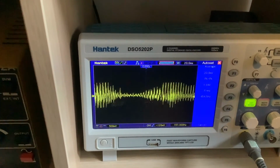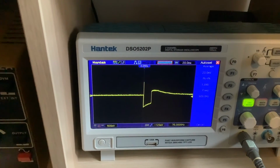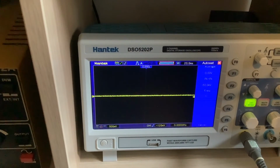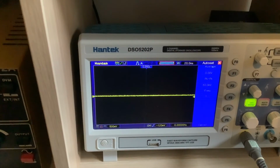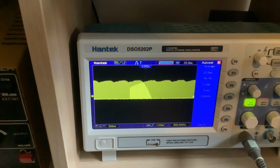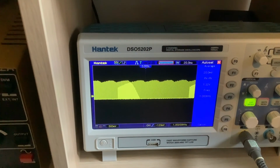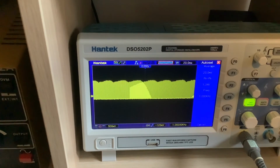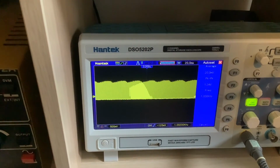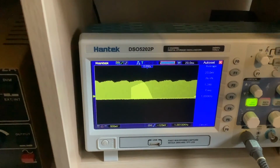Right, okay, what I'm going to do is flick the button on the screen now to engage the tuning tone. You have to take my word for it. And now, you've already seen, it's dropped out, and that's because I've switched out the microphone by doing that. Now, if I engage the PTT, there you are. And the microphone's not engaged at all. And that is giving us that tuning tone, which is certainly not a sine wave, but is more sinusoidal than it is square, and so we're going to use that for tuning purposes.